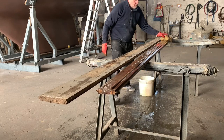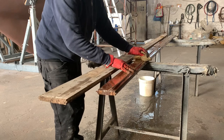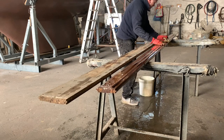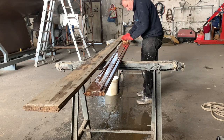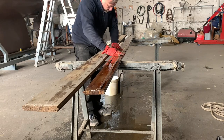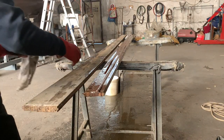It's time to rinse all the brass and all the dirt. You can see it's brown water. After that I will move the brass to another piece of wood, use some screws and fix those brass strips, and start to polish. But before polishing, you can see it starts to get the original color. I need to sand with 600 grit wet sandpaper.